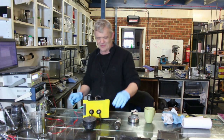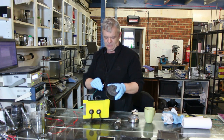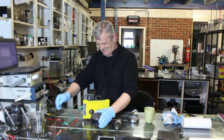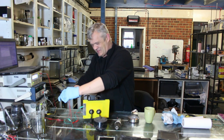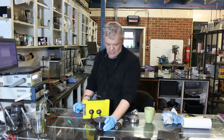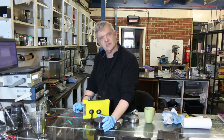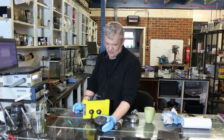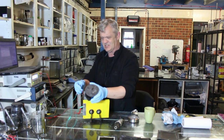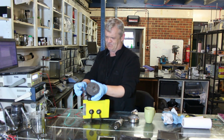The really cool thing about this is the power density of it. You will notice the rubber gloves — that's because I'm actually a little afraid of it. It's quite a powerful thing and it does arc a little bit. This is an 18 volt scooter motor taken from an electric scooter, and it takes quite a lot of power just to turn it — quite a lot of torque. It draws about 4 amps or so just to turn it, and it does arc a little bit. Hence the rubber gloves.